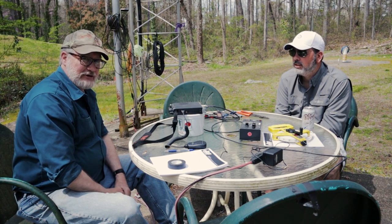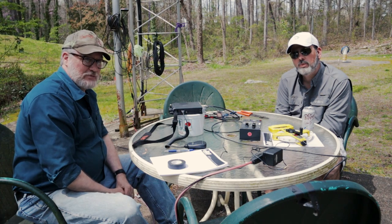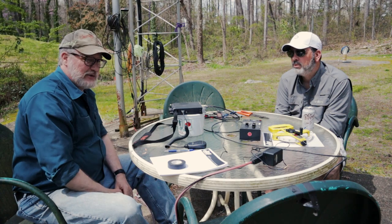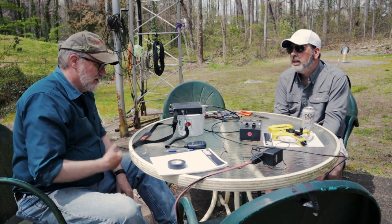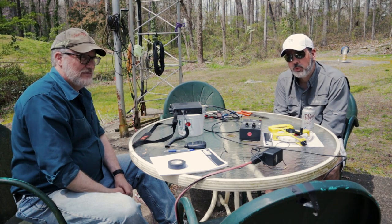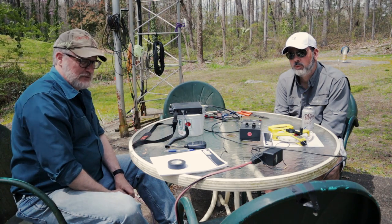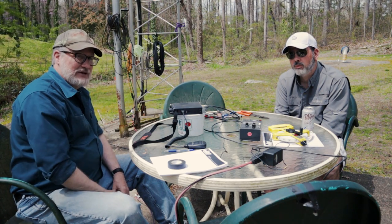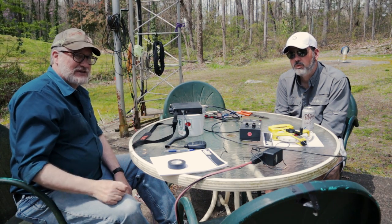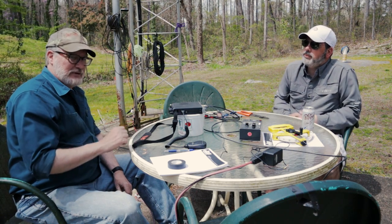About 2.5 to 3 watts. Not a whole lot of power, particularly given the fact that we're not running a mode that's really designed to work with low power, like FT8 or even CW. We're just running plain old sideband. And we're in the middle of a big contest weekend where there's going to be pileups. We're not the only person trying to call WX3B. What was interesting, when we called him, somebody else was stronger, and he called them first. But when he called them, he said, N4, stand by. So even though we weren't the strongest signal, he was still able to copy us.